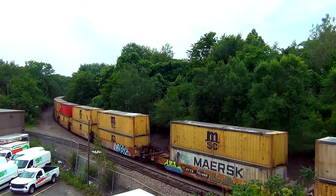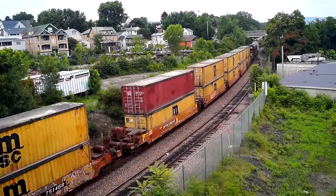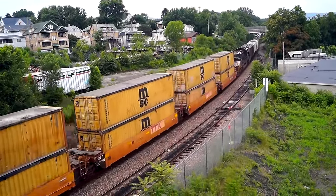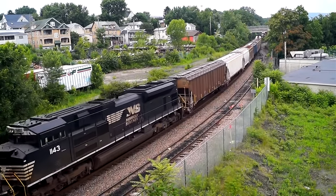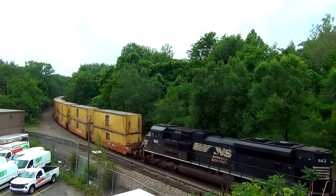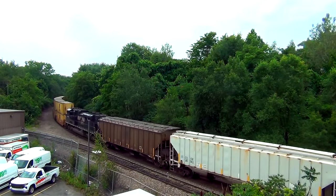I've heard that over on the CSX A and WP subdivision there has been some changes. At first it was a 1x1x0. The mid-train locomotive was almost always at full throttle or full dynamic. North of there, going northbound, was the ruling grade for the subdivision with a sag just south of the ruling grade. Now most times, except for much shorter trains, it's a 2x1x0 DPU configuration.